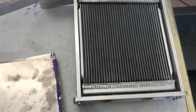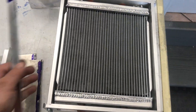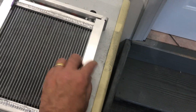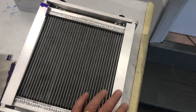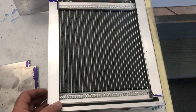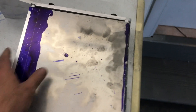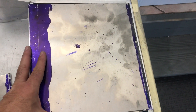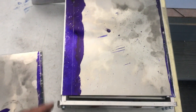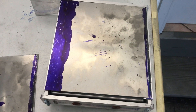So I figured I'd use the same technique that Wizard Cooling uses on their fan shroud. I picked up some 16-inch angle iron, and this way I can screw them into the side of the bracket, then have the sheet welded on - it'll be a perfect fit. I also like the look of the TIG welding going down the side, so that's what we're going to do with regard to the intercooler brackets.